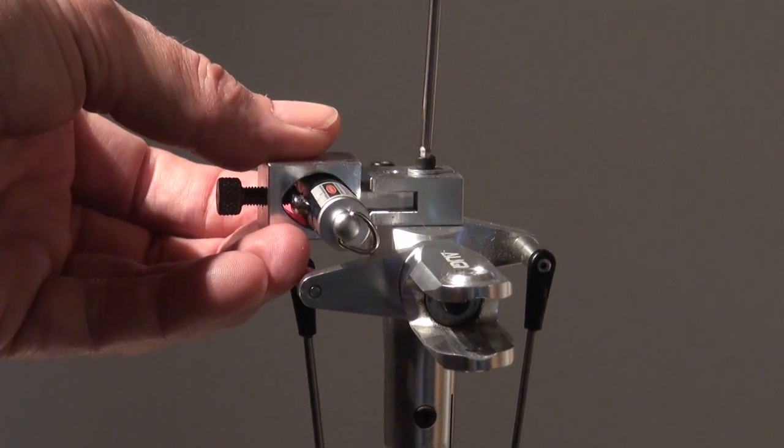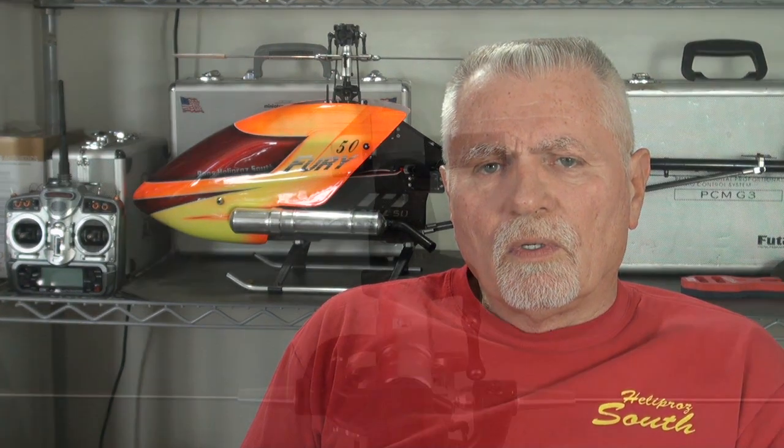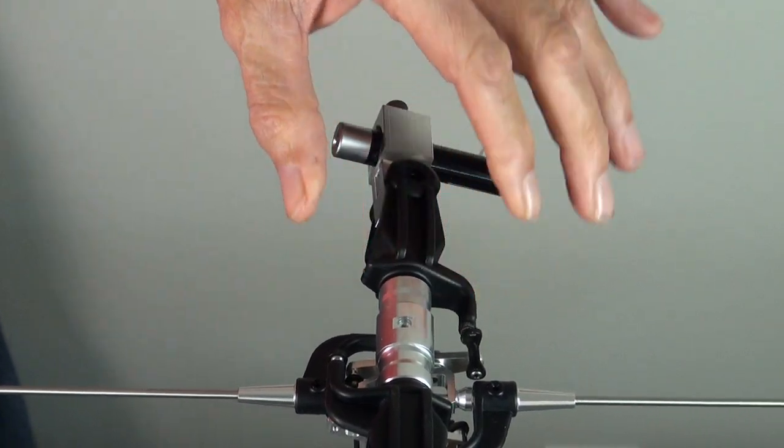If you can't remove your head button, or you don't have a hole in the top of your head block, or you simply just don't want to bolt the tool on top of your head block, it's a very simple matter to tape the blade grips so that they're stationary temporarily while we mark these four reference points.